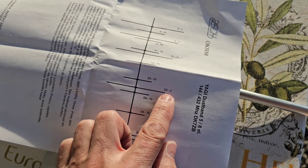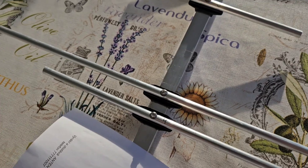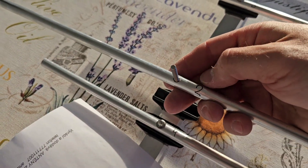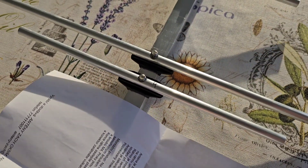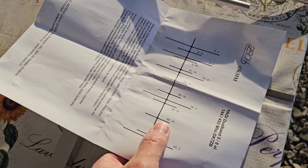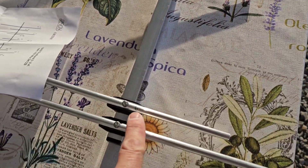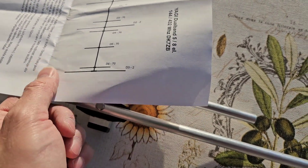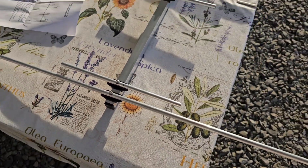We have director number 2 for 70 centimeters and director number 4 for 70 centimeters. This is director number 2 for 2 meters and number 4 for 70 centimeters — that's okay. Then we have D5 and D6 for 70 centimeters, and the rest is number 3 for 2 meters. The number is on the opposite side, but everything seems arranged correctly.